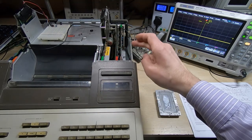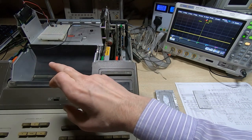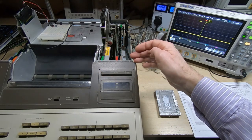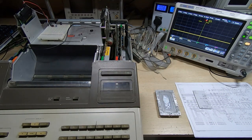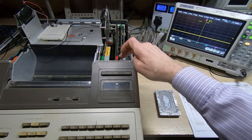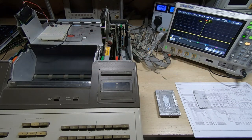What I found was that the PPU is doing exactly the same thing as the LPU — it's branching to the block 3 code, so it thinks it's the LPU. Effectively, both processors at startup think they're the LPU, and that's why it's not getting very far through the startup. The PPU, once it's identified itself as such, should jump to the monitor program in its own ROM card, but it's jumping to the block 3 code instead — thinking it's the LPU.